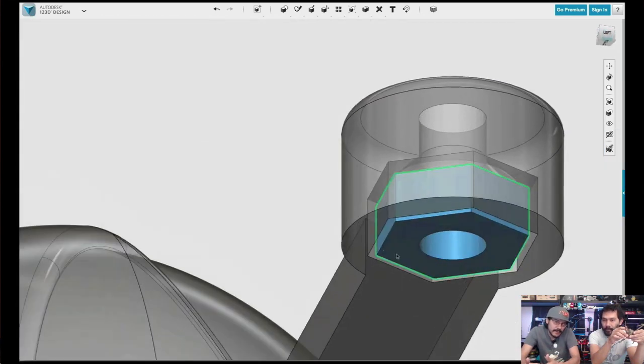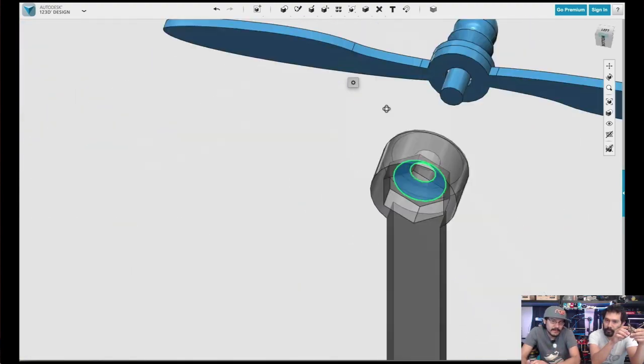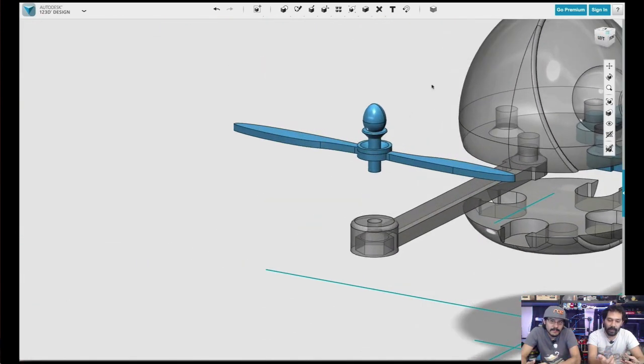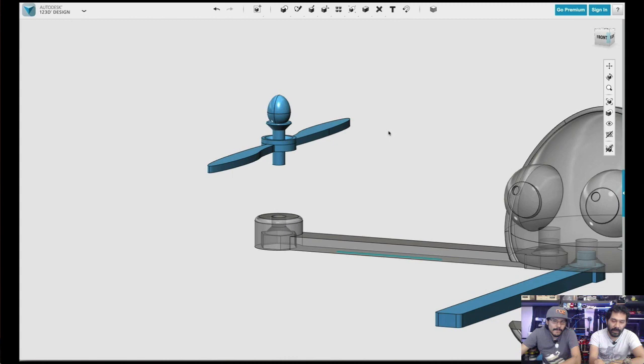And again, there's also a chamfer. Let me hide that real quick. There's a chamfer right there so that it prints, it tries to print good. You still have to clean it out, but you're also accommodating for glue here that we're using to stick everything together. So you've got to account for those 2 things when creating your offsets and clearances for any snap together parts.